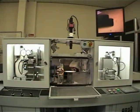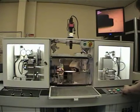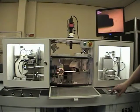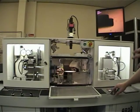What we can find here is that the upper nozzle is actually cutting further than the lower nozzle. So what we need to do now is come in and adjust that arm going forward, and we'll run it until that edge starts to get square and then we can re-check it on the centre line.